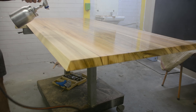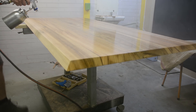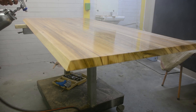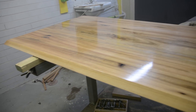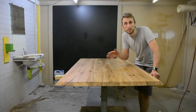At this stage you might look across the table and see what looks like a dry spot. Do not touch it up — it will only make things worse. Wait 10 minutes, come back and look at it once you're done spraying, and you'll see it's actually really even and nice. That's only because the other side of the table is starting to flash off already.